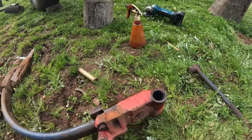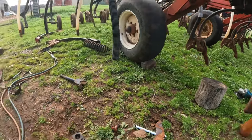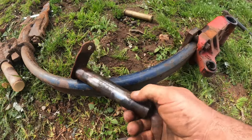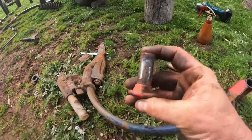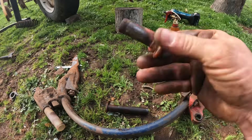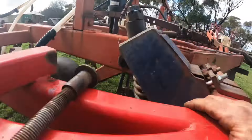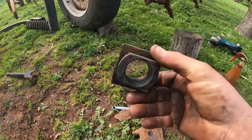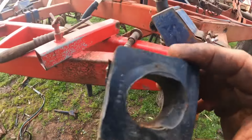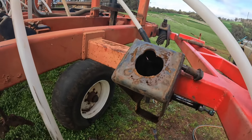Same on here, these can wear quite badly. These generally don't wear, but the pins wear quite badly — you can see this one has got a bit of wear in it. These little pins wear, but they only wear on one side — one side in the middle and the other side on the outers. So you can actually turn these around 90 degrees and get a second use out of them. These little plastic bits that go on top are sacrificial — they wear out in no time at all. Make sure you keep replacing these when they're worn out. If you don't replace these, the top of your holder wears, and that gets quite a lot more work to fix.